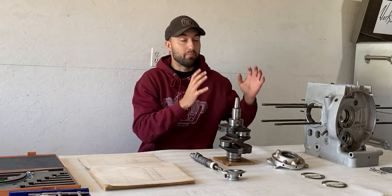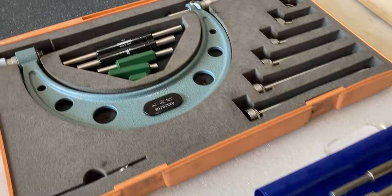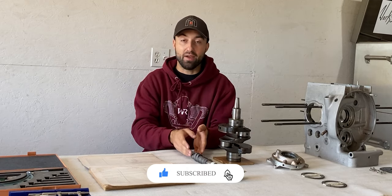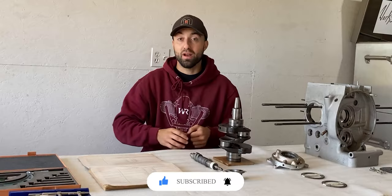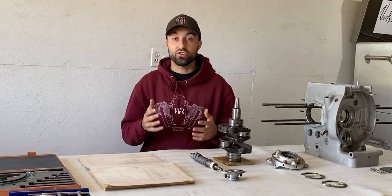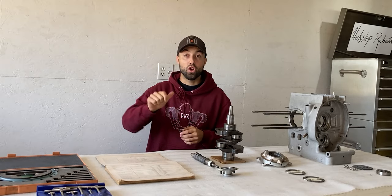What's up everyone! Today I'll be focusing on the BMW R60/5 motorcycle engine. Off to my left I have a bunch of measuring tools which will give me the opportunity to measure all the components that came out of this engine, like the crankshaft or even the camshaft. Down below I also have the service manual, so once I have all the parts measured up I can compare the values to the factory specifications. Once I have those values written down I can figure out if it's within spec or out of spec, and everything that is out of spec I have to repair or replace.